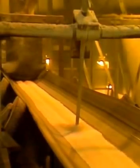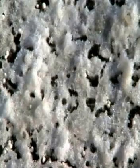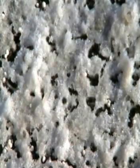Let's discover what CMA is and how it works. It's made from limestone and vinegar, so it's biodegradable. When spread over snow, CMA pellets release heat as they dissolve and burrow to the surface. This process prevents ice from bonding to the road surface and makes snow removal easier. Time-lapse photography demonstrates how a single pellet works when placed on a block of ice — it successfully bores through the ice without leaving the briny residue common with salt.